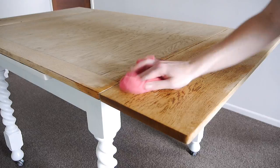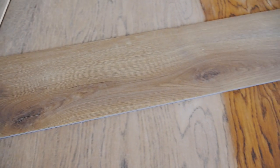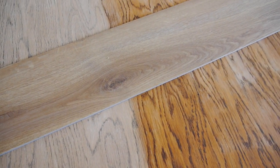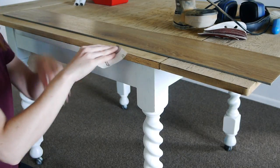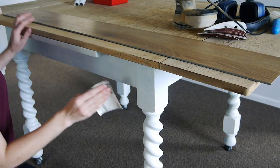Here's the flooring sample we've chosen — you can see the bare wood almost exactly matches the sample plank, it just perhaps needs a slightly ashy effect to match perfectly. So this is where I had a complete change of mind: instead of doing a stain, I decided to do a liming white, but in the same stain and varnish combo we've found so durable for this table throughout all its makeovers. All that was left was to lightly hand sand the edges and start thinking about a centerpiece.